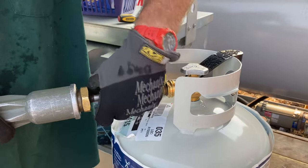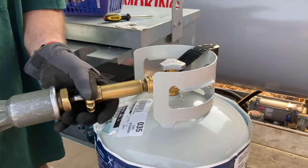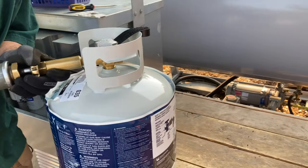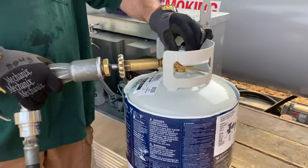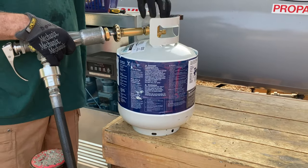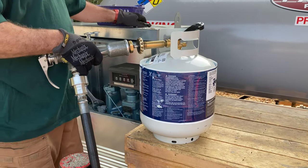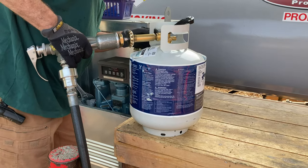On Ferraris they have left-hand tighten bolts too. I used to work at a Ferrari dealership as a tech, and the head will have a right-tighten, then a left-tighten, then a right-tighten — they do that to keep it from unscrewing. I had to go to Tacoma Screw to get a replacement screw for an antique one that had already rusted out, like a 70s Ferrari.